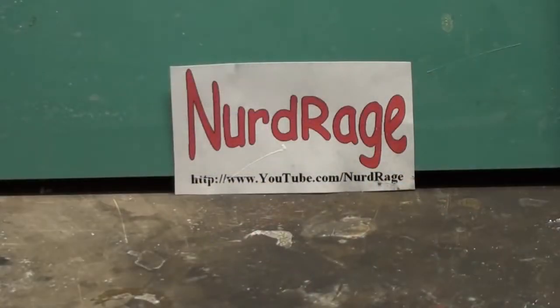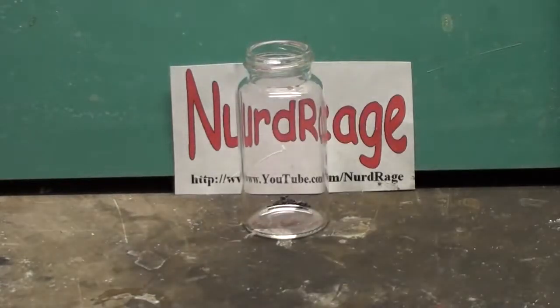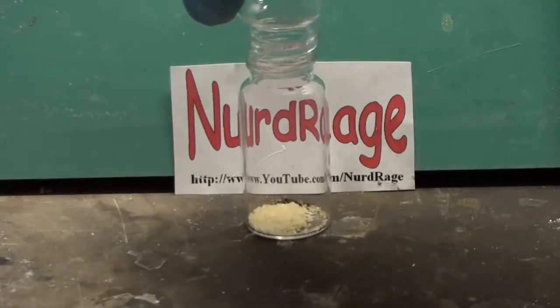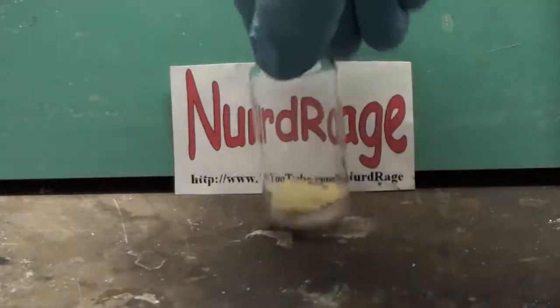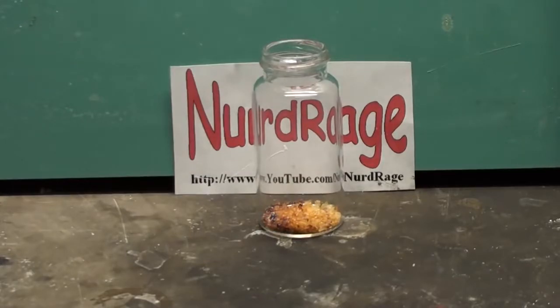Now we need to make the electrolyte solution. First, start with 127 milligrams of pure iodine crystals and add to it 830 milligrams of potassium iodide. Already you can see it reacting to form brown potassium triiodide.